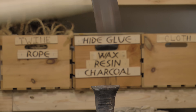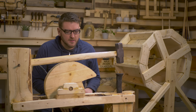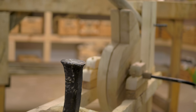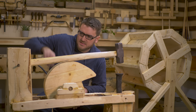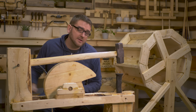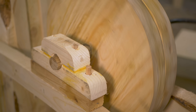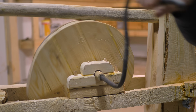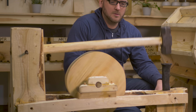Just took a few small tweaks to actually get this running a little more smoothly. First thing was adding a second cam to give a little more width and tolerance for any wiggle in the handle landing on it. Also added some wood pieces to prevent the hammer from wiggling too much. The metal crank was starting to bend, so I reinforced it with a wooden dowel for more strength. The housing now holds the bigger axle all the way around so it doesn't bounce out — and now it actually works pretty well.